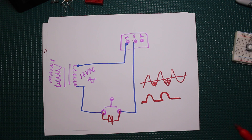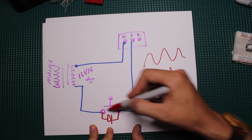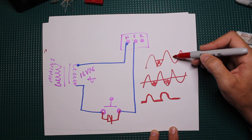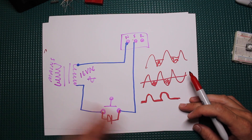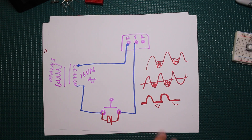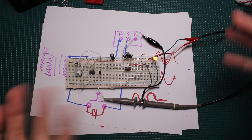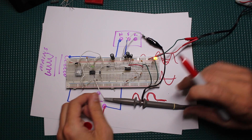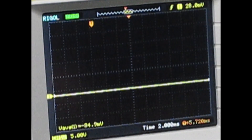The trick is: how do you detect when the button is pressed? When you press the doorbell, you suddenly have a full AC sine wave because you've just shorted out the diode. So the trick is to detect the negative portion of the waveform — normally when the button is open, you only have the half-wave. The focus is to detect that negative portion, and I actually have a circuit here working that does just this. I hacked this together while I was watching the show.